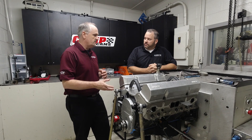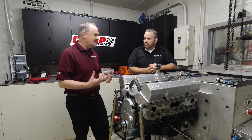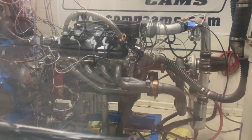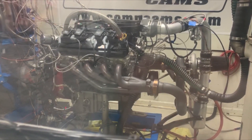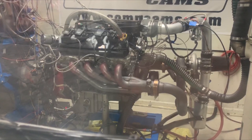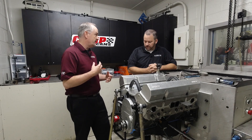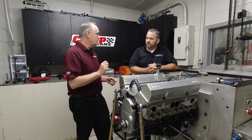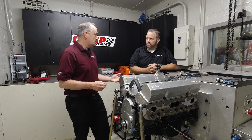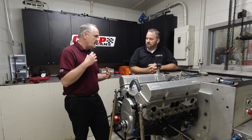One of the things you have to understand is if you took a generation or two back of cam designers — your Ed Iskenderian's, your Harvey Cranes — they had to go to the dyno and learn everything there. They had to listen to the dyno, hear what it's doing, think about what the valve's going, and go, 'I heard this, the dyno curve did this, I think the valve did that.' So it was very, very subjective and not very accurate. Now we actually have a pretty good idea from all the dyno testing — if we make the valve do what we want it to do, how is the engine going to respond? That's why you have two dyno cells next to two spintron cells.